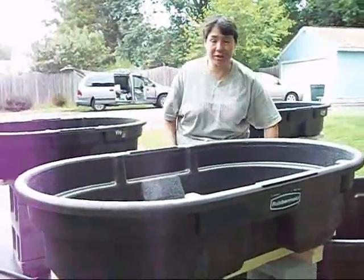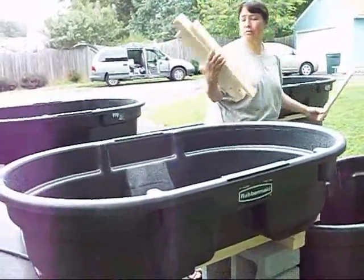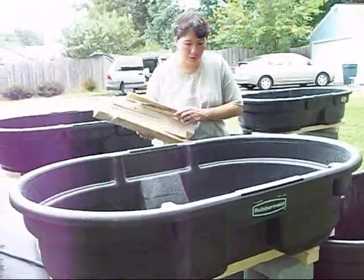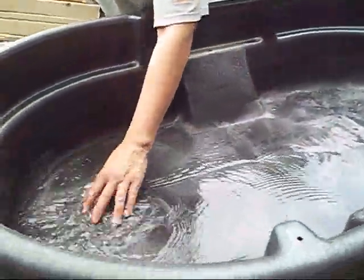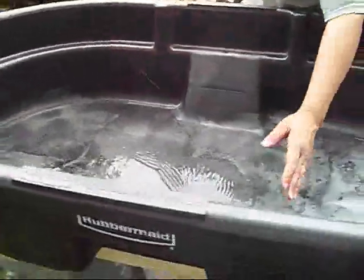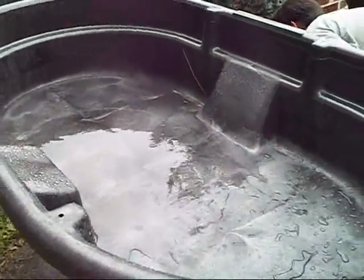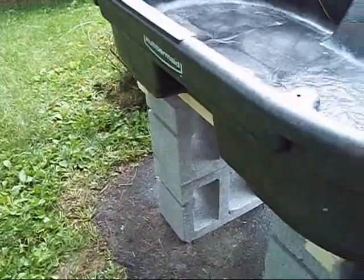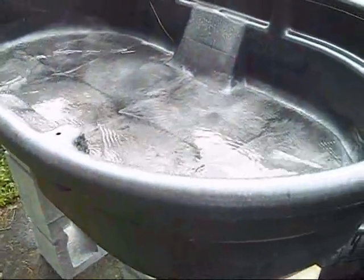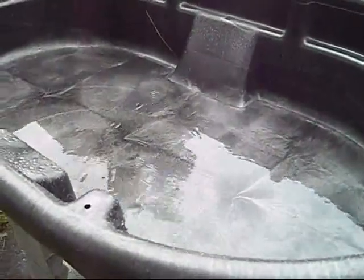What I've done is put a little bit of water in each of these, and I've got my leveling tools — some extra 2x3 and 1x3, and some shims. If we look in here, this guy is wet here and not wet there. The water pattern is pretty even left to right — it just needs to be boosted up on the back end. I'll lift up and put another piece of wood and let it settle. That's pretty good — the 1x3 did it.